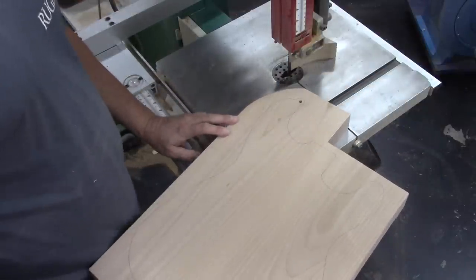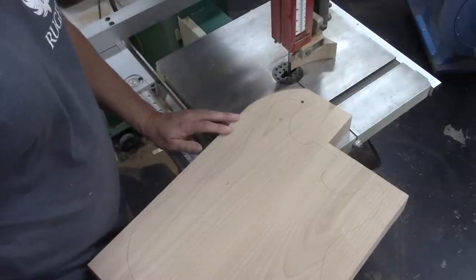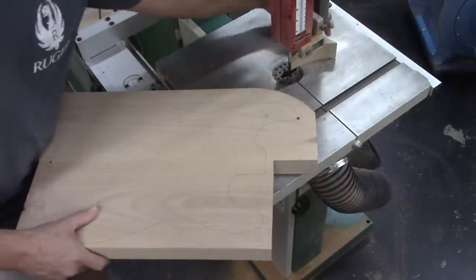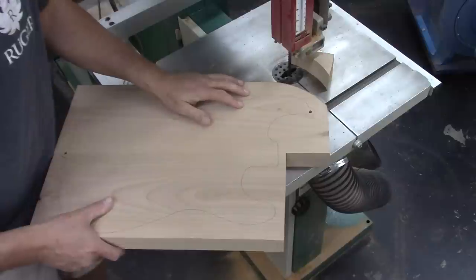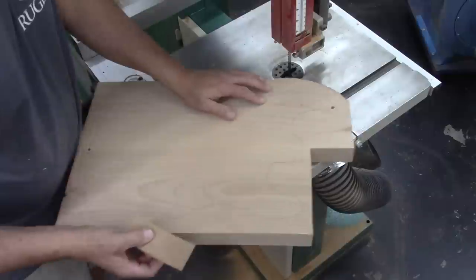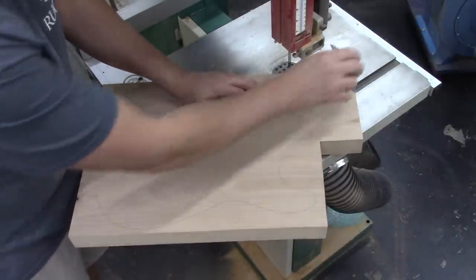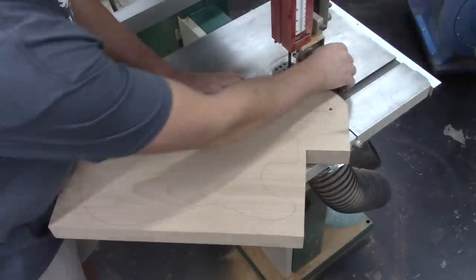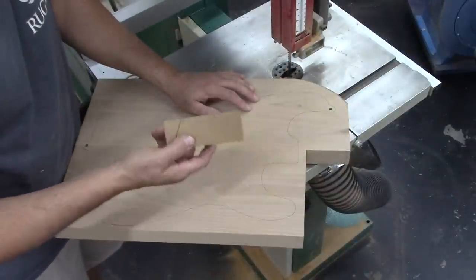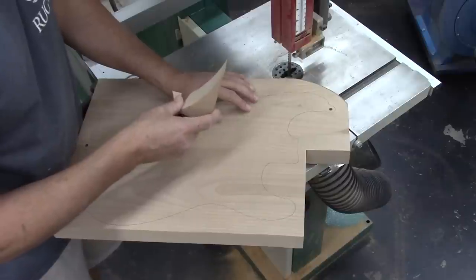All right, a couple more safety things that I wanted to wait until we got to where we were using the saw to actually tell you guys about. One thing, you'll notice that this chunk of material here, I left where it is until the saw came to a complete stop, okay? That wasn't bothering me right there. This piece could stay right here or right here. It wouldn't have bothered me in the least little bit. I could have just kept on sawing and no big shake. But if you really got to move it out of the way, let the saw blade come to a complete stop.